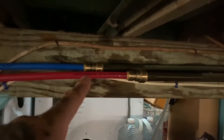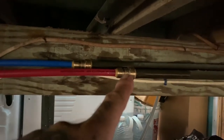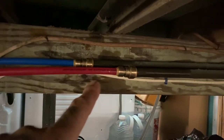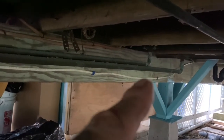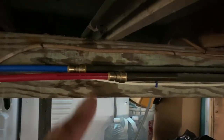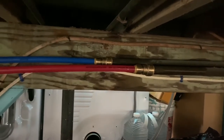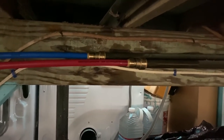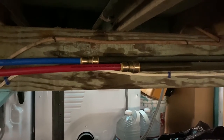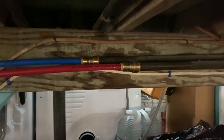And I don't know if you noticed on the time lapse, but there was some pretty rusty water that came out of this when I first cut them. And that's because these pipes are below all the rest of the pipes. So this whole section of the pipe was full, basically, and this water was just sitting stagnant. So it's good that I drained those lines and then they will now be used. And it's kind of funny, I even smelled a little bit of bleach in the line, which was from when I did the bleach in the catchment tank.